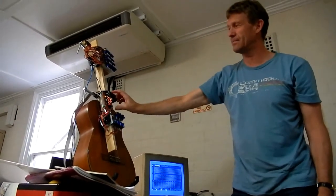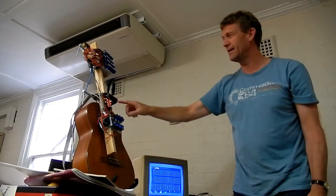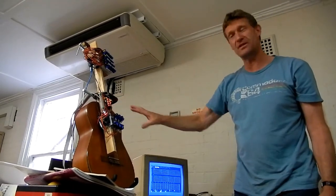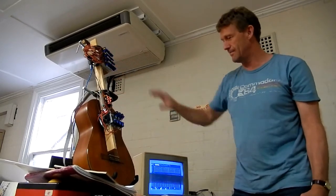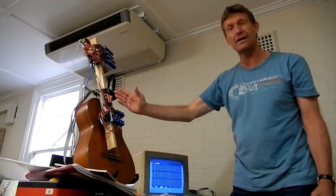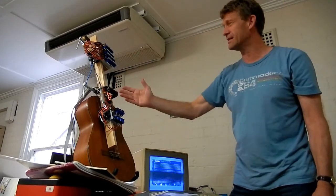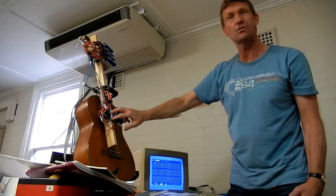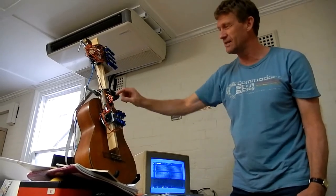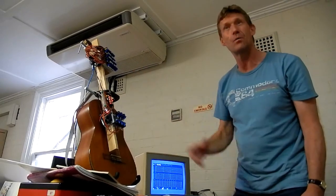This front board I built from scratch is off the user port, as I mentioned earlier, has opto isolation, so it protects the Commodore 64 from any power coming from here back to the Commodore 64. It's a one-way circuit. That's how I started, and I've kept it nice and clean by using these, what they call shields. Each motor has an individual connector, so it keeps it simple from a wiring perspective.